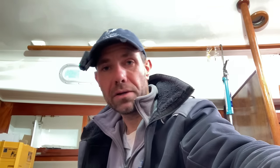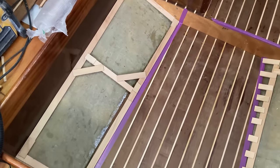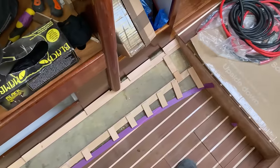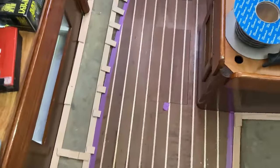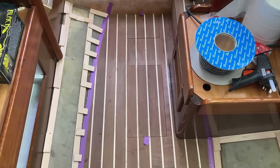I'm back on the boat now — it's a few days after the last bit of video. I've laid up a second sheet of fibreglass with epoxy in the workshop. Whilst waiting for that to set up yesterday, I started making some templates for the pieces of floor I need. The tried and tested method of using strips of wood and a hot melt glue gun — there's the port side template, and I've done the same on the starboard side. I want about 10 to 15mm overlap onto the flat bit of floor, which is why there's that purple masking tape down there.